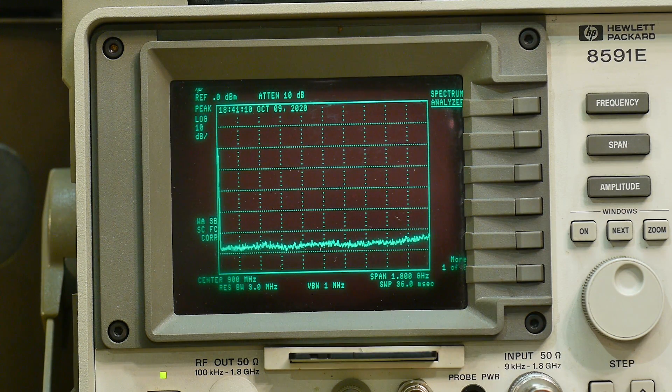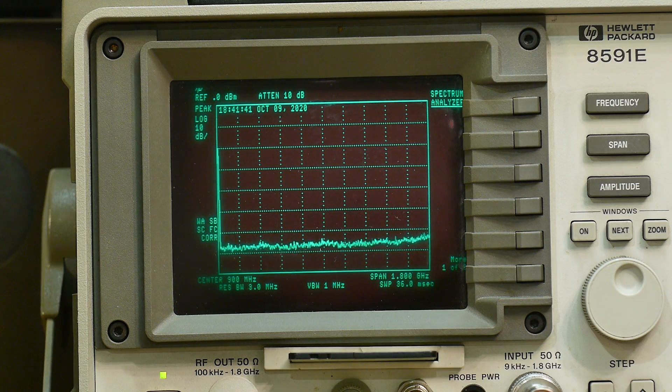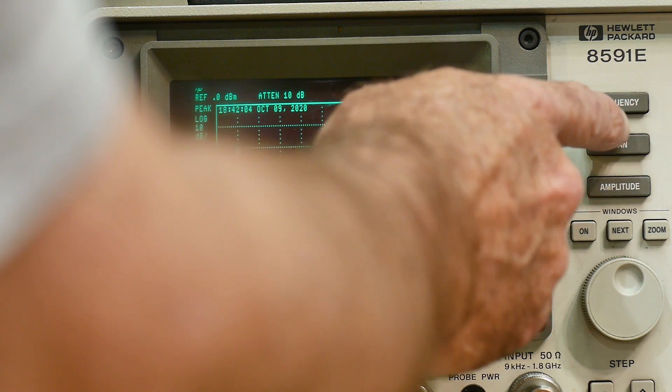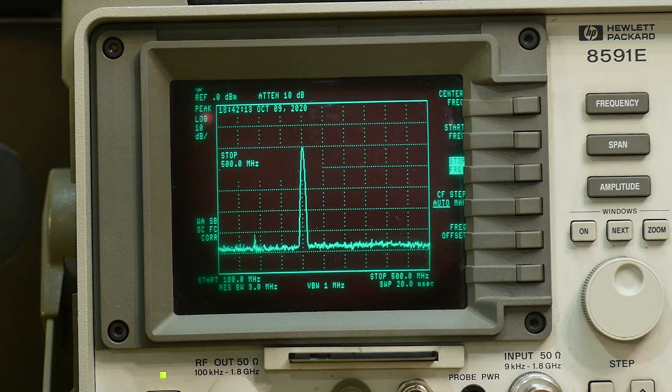Let's do sweeping. Taking the default, it's sweeping between 35 and 100 MHz. Let's sweep between 100 MHz and 500 MHz. The menu system's kind of goofy. So I have it set up to sweep between 100 and 500 MHz. Let's set up the analyzer: start frequency 100 MHz, stop frequency 500 MHz. It's sweeping really, really, really slow.